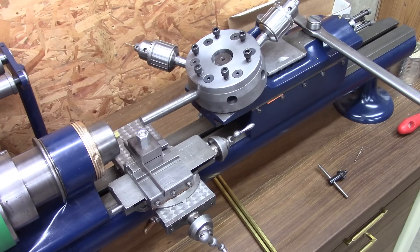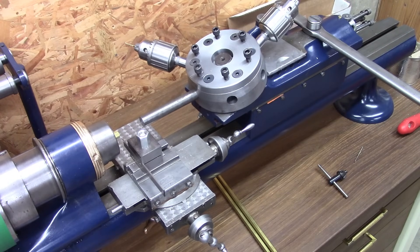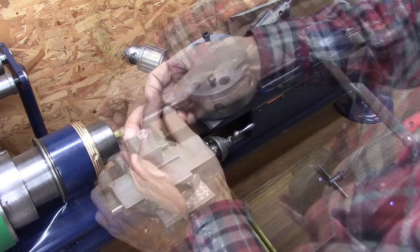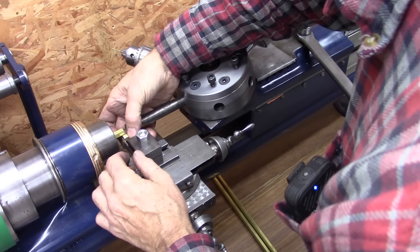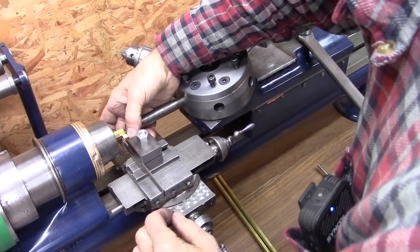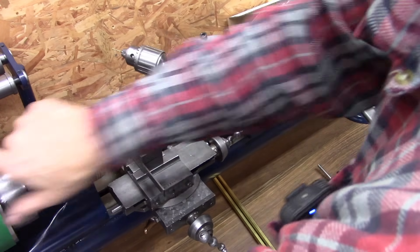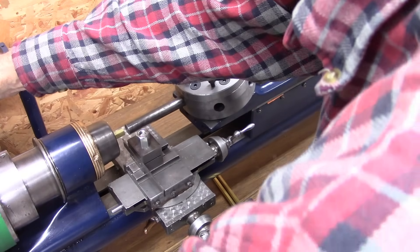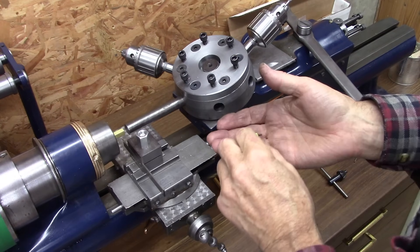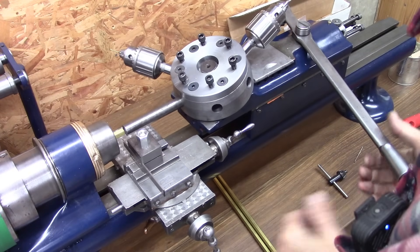Right now I've cut a bar in here and that bar is going to be our depth stop. What I want to do is put that on the side of the blade and pull my hex stock out to the same level. I've got the collet snug now, and that's where I want to cut it off after I drill and tap it. So I've got to set my turret stop so that I'm just touching this.